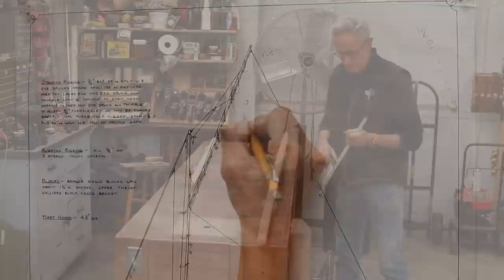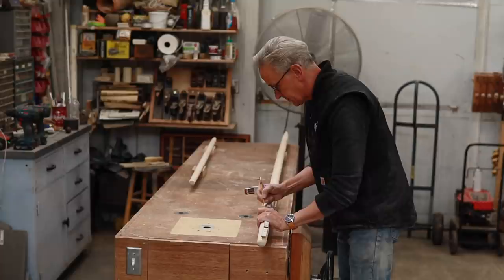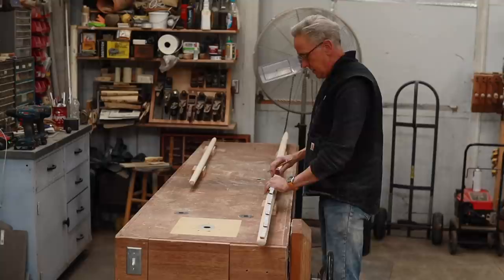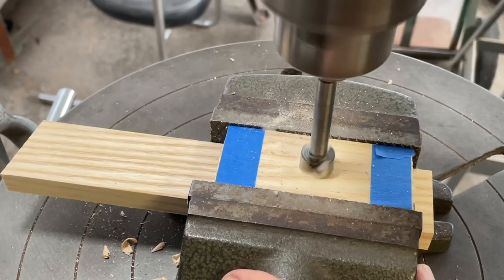On the bottom side of the gaff, I measure over one foot five, which is 17 inches, and then three feet. I'm going to make a couple of little wooden stops and make those out of ash. I cut two half-by-three-quarter inch pieces of ash, taped them together, and drilled a five-eighths inch hole between the two of them.